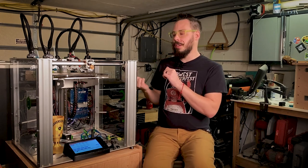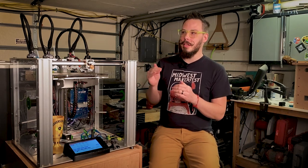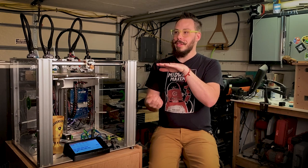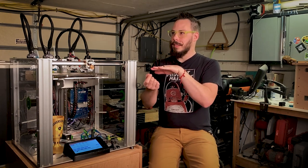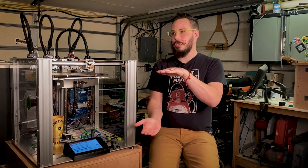For most of my tools, even though they're like 5 millimeters, I set that Z at like 20, because I have heard the sound that it makes when a block catches the bed as it's undocking, and I don't ever want to hear it again. So I make that offset nice and long. If you had a Super Volcano, there's no reason why you couldn't make that Z 100 millimeters. But really it should be something sane like 10, because as soon as it docks to pick up that Super Volcano tool, that offset's active and it says, oh, Z just changed by 100 millimeters. So I have to accommodate for that plus 10. And that's how that extra tool length happens.